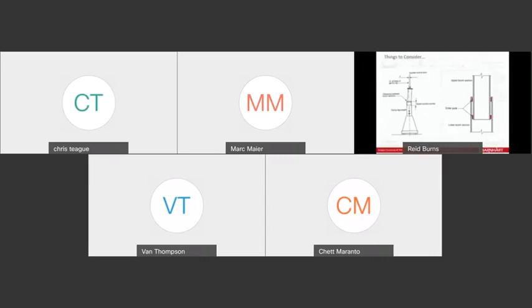It's also worth pointing out another issue you face when you use hydraulic gantries with the telescopic cylinders, in particular, the boom-style cylinders. And so these boom cylinders have slider wear pads that you can see here shown in red that keep the section parallel relative to the other sections. And if these slider pads are out of tolerance, you stand the chance of inducing additional drift into the system when the cylinder boom sections are skew relative to each other. And so, again, that's why proper maintenance is important, making sure that those wear pads are within spec, and making sure that your arrangement is set up within ASME tolerance of levelness.